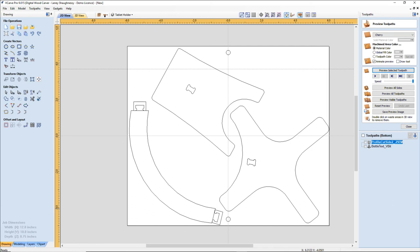So Dennis, you were making comments when I was talking about the dog bone fillets, about using a small chisel. Yeah, you can use a small chisel and round off your square edges for that mortise and tenon joint. But I'm not using hand tools, I'm using a machine. If I was Roy Underhill, using hand tools, then yeah, I'd use a small chisel and round off those corners of that tenon to get it to fit into that mortise, or I'd just square up a mortise with my chisels. But I'm using a machine, so chisels are out. But technically, you could just cut it and use a small chisel on your parts.